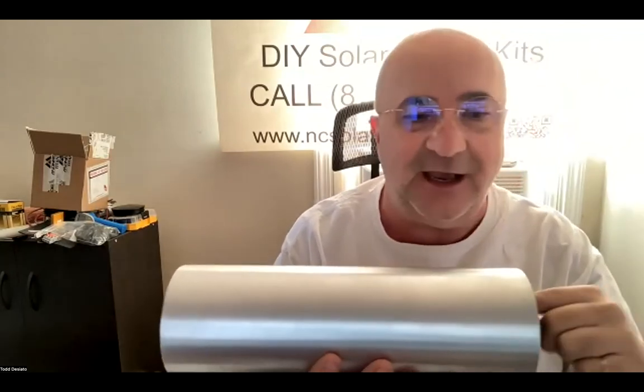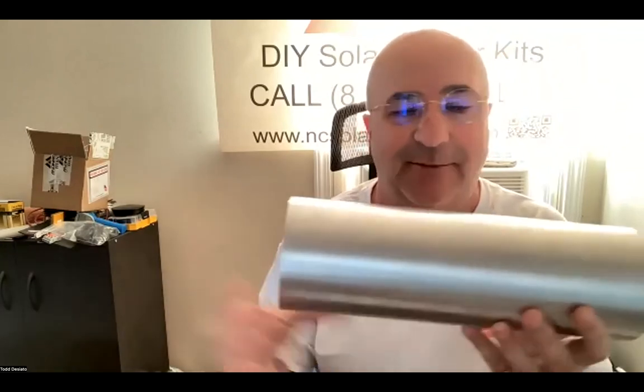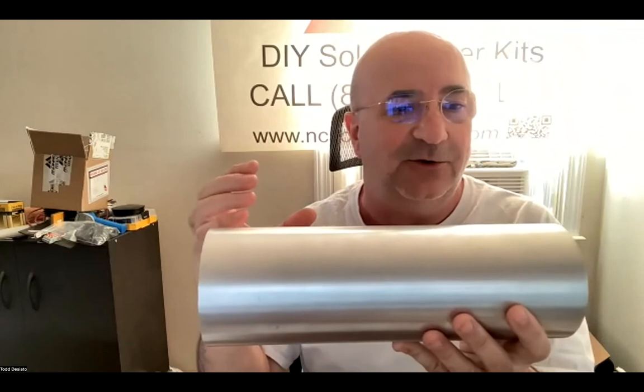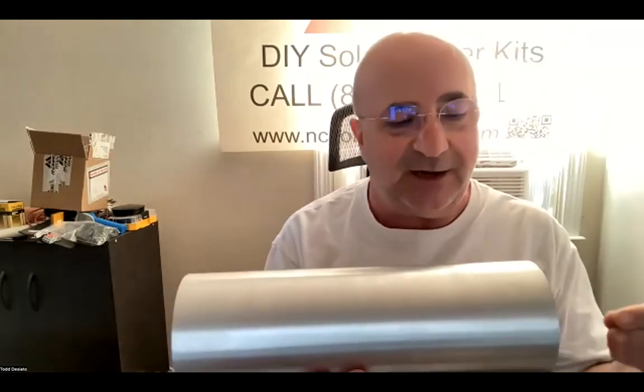In a vacuum, it would just have an electric field radiating off it. But inside, I'm gonna have a spark gap. And when I reach the level of the spark gap switch, then as much of the current as I can get out of those capacitors is going to snap across that spark gap. And all the charge on the cylinder is going to rush inside a repulsive electric field, which will push this along. And in a vacuum, what would happen is it would be ejecting a Poynting vector of electromagnetic field in that direction, and then inside would be another Poynting vector in the opposite direction, but I've got end caps to trap it so that Poynting vector can't get out, and the momentum just carries the thing along.